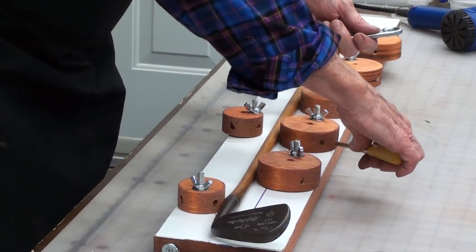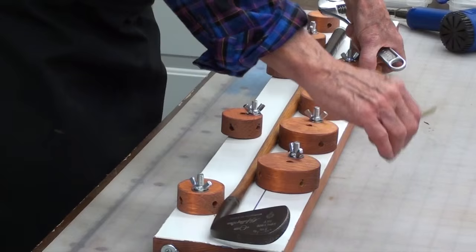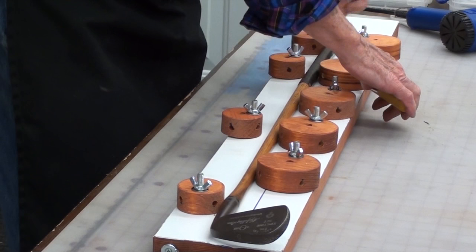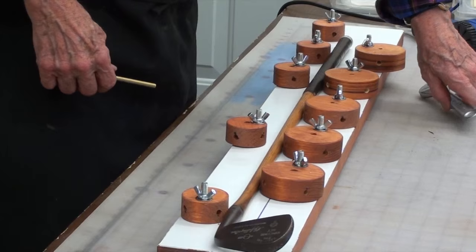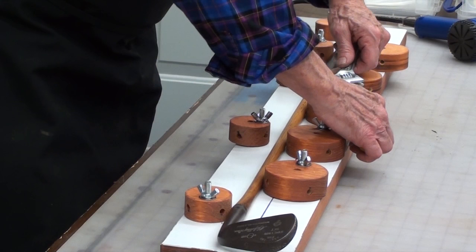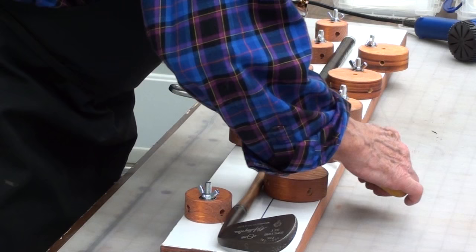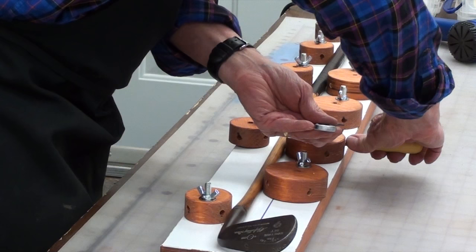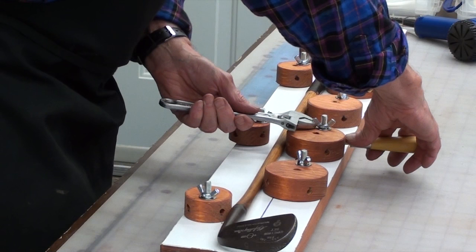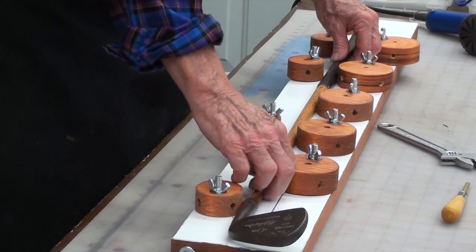The main one is this one right in the center, and I want to make sure that it's still tight. Then this one up here where the grip is, I'm going to bring that one down to push in just a little bit also. I've made these a little bit away, so I have to go back and loosen this one a little bit and then bring it down close again. I want all of these large cams to be basically touching the wood. This one I can see is not quite touching, so I'm going to loosen it and bring it a little bit closer. Now they all seem to be touching. We've got it bent slightly in the opposite direction and it's pretty flat along the board — that's the way we want to have this set up.